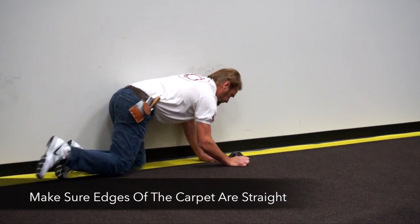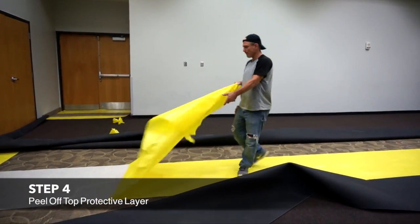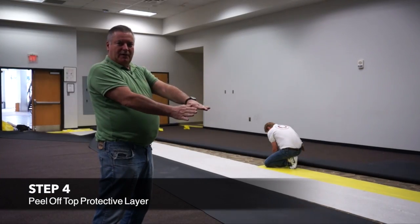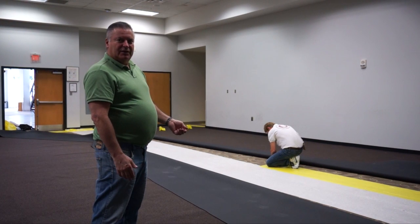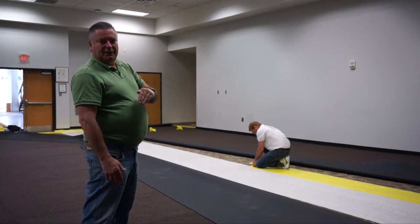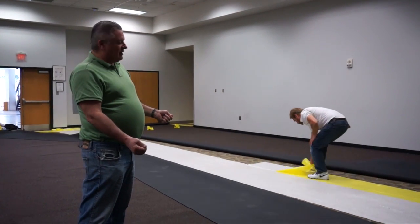You still have to shift and move the drop of the carpet, exposing the dry adhesive. They fold about both sides. We'll fold the carpet from the right drop to the left drop and you have a secure installation. Then we will proceed to the wall, pull the carpet from the wall back, expose that Lok-Lift installation product.